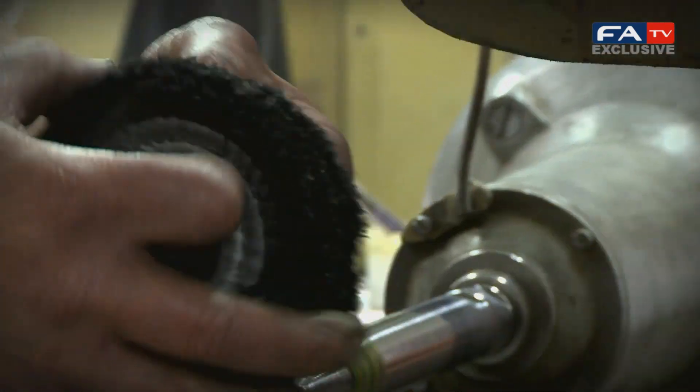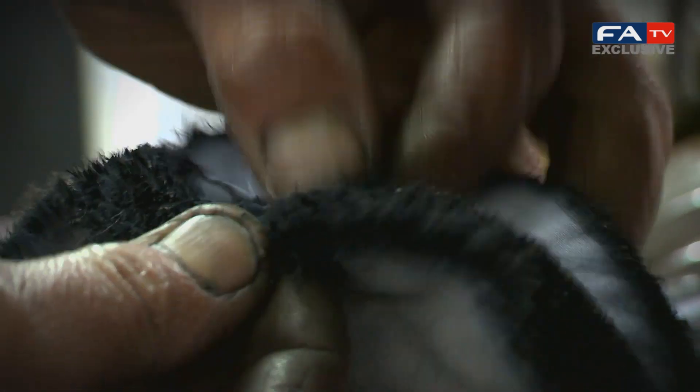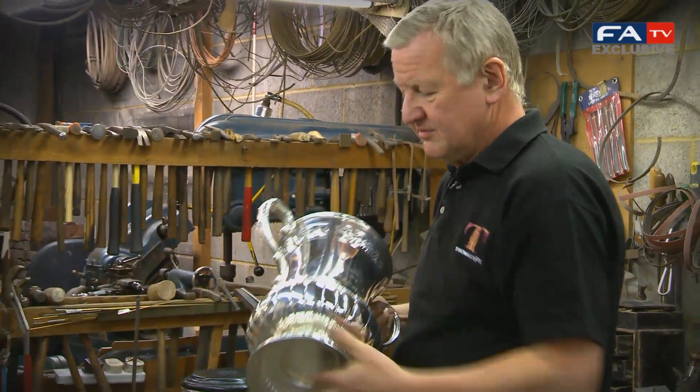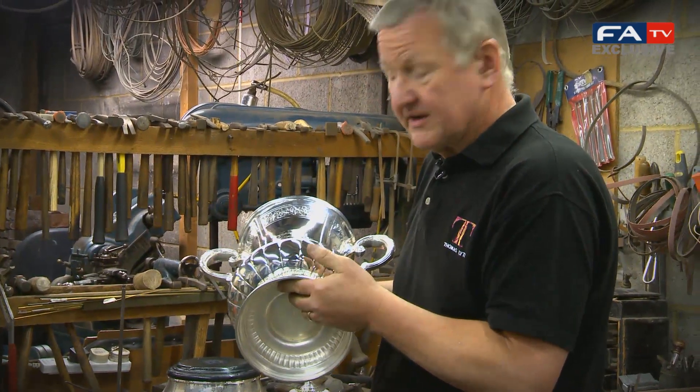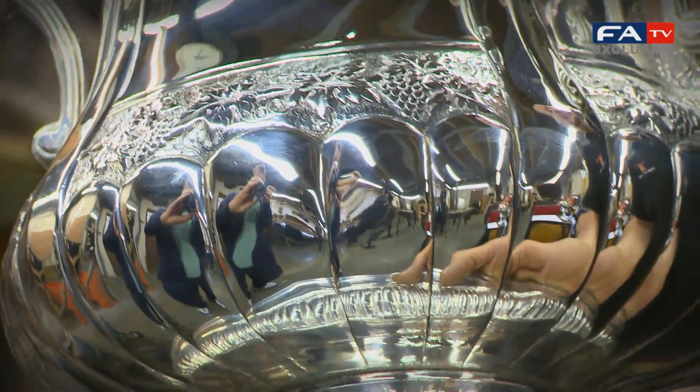It's like linen and it gives you a much shinier finish. It takes out the staple lines. And the final will be a nice little finisher — a lot softer, you can feel it's a lot more open. That's the finisher. Mark's totally done. I think that shows you one of the stages of getting the cup ready for the final. You can see now that the little dent that was there has now been pushed out.